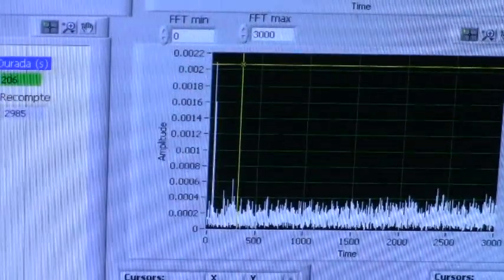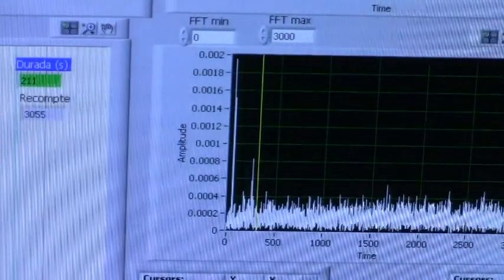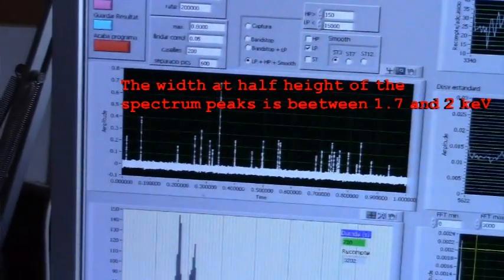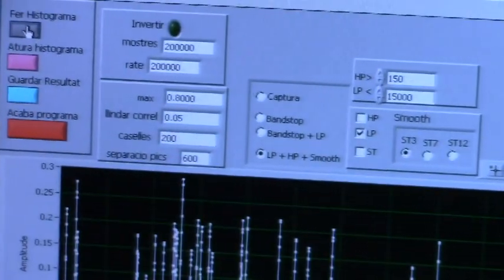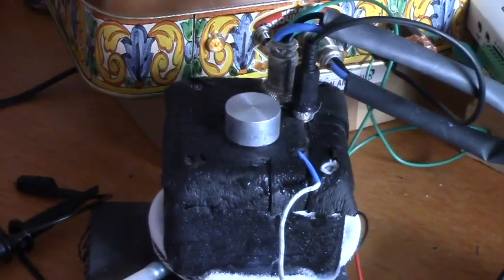The detector circuit is by far the most delicate part of the assembly. Electrical noise can originate from the photodiode, transistors or resistors, due to thermal effects, but it can be greatly reduced if the detector cools down. If a Peltier cell is used, it can be easily cooled to -15 C, but you must avoid introducing noise due to the power supply, the fan or the cooling water circulation pump. Noise can also be due to electromagnetic waves from the outside, and to reduce it the circuits must be placed well shielded inside a metallic box. To minimize noise, the circuits are powered by batteries.